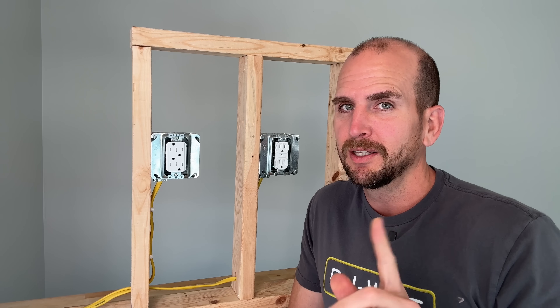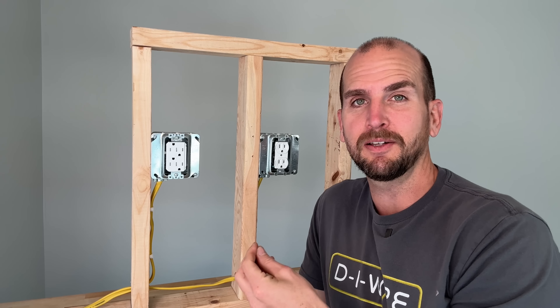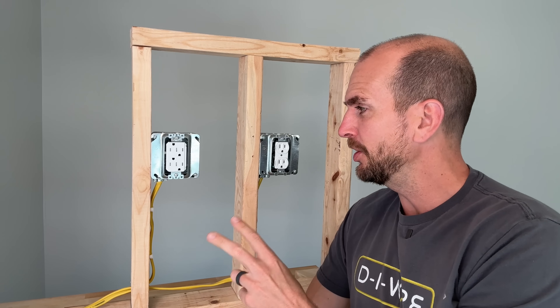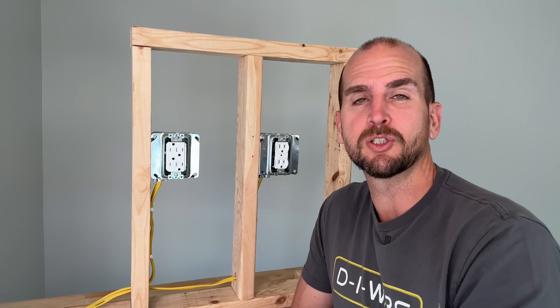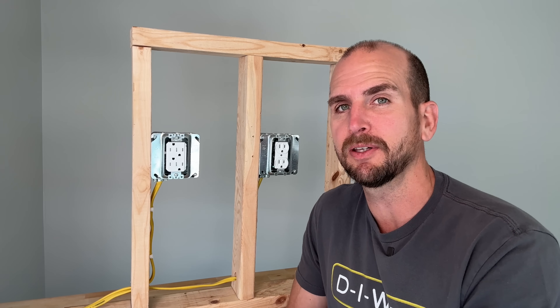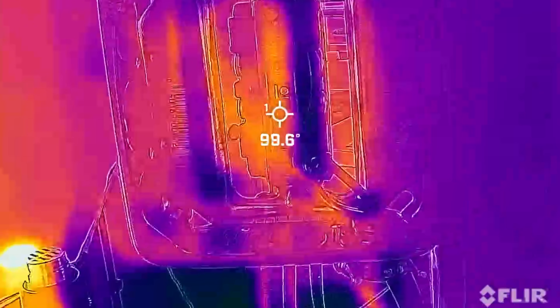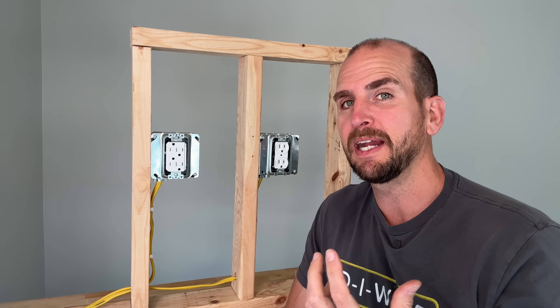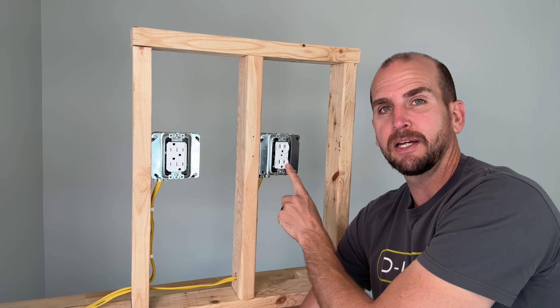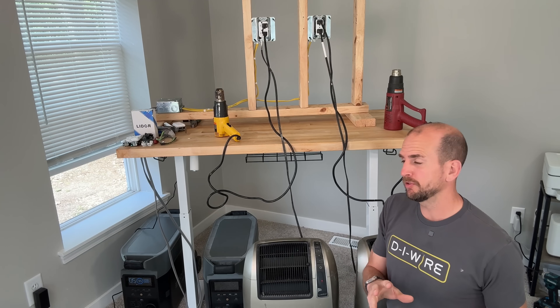I was a little skeptical, so what I want to do today is cut open this outlet to see what's on the inside, and then run a duration test where we max it all the way up to 20 amps — which it should handle even though it's a 15-amp outlet — to see if it heats up. We'll use a FLIR thermal imaging camera, run it for about an hour, and compare that to our baseline: my favorite commercial-grade Legrand outlet.